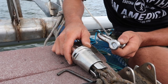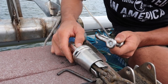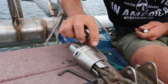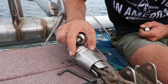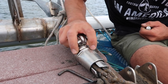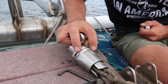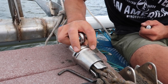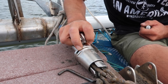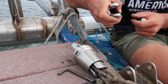This says S25/16-3/8 inch, so it's 3/8 inch. It says UBS, I'm pretty sure that's ultimate breaking strength, is 9.8 tons, I think. And WLL, working load limit, is 2T, so probably 2 tons. That's crazy, 4,000 pound working load limit.